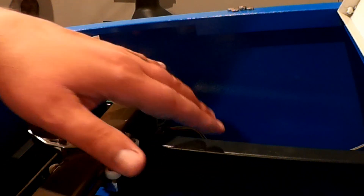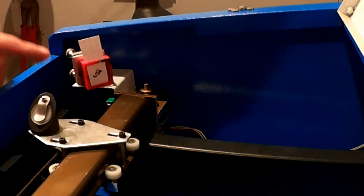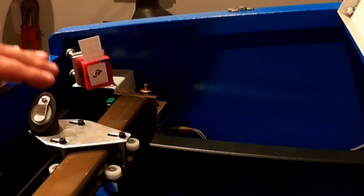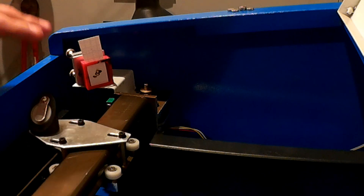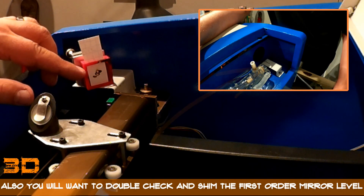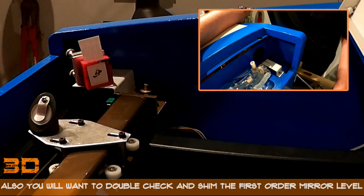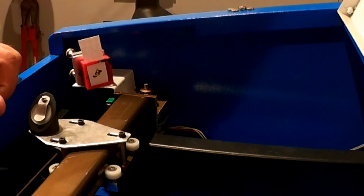I talked about that in the last video, and after creating that video I wanted to do this video to really demonstrate it, because I didn't explain it completely on how to determine it — and this is probably the most critical part. We've trued up all the other pieces; now we really have to get this trued up inside the sheet metal. You can see this is probably at least 5 millimeters or more off, so my effectiveness of this laser over this range is going to be very limited. This is what I have to get straight, and this is what you have to get straight too.